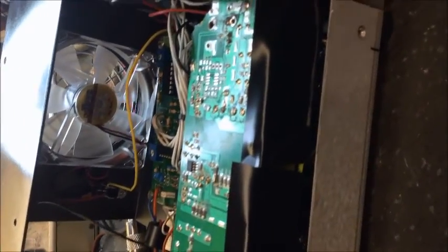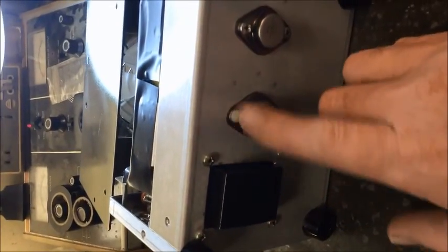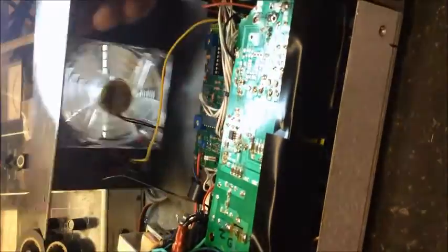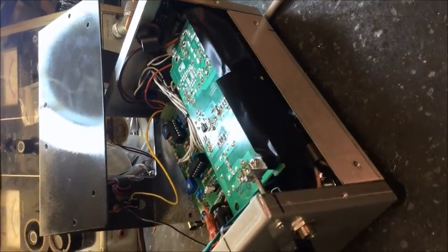These guys have been buying this one certain power supply with the Motormouth Maul modulators that need 3 different voltages, and they're tapping all 3 voltages off that supply. Well, that's good, and it works. I'm not saying it doesn't work. As you see, I took it out of the power supply's case, because it was an open frame that I'd bought, and I mounted everything on the bottom side of this 3-pill case that I had gotten. Basically, I went ahead and tapped all 3 voltages just like them guys do, and the problem I was running into was my plus 24 volts was actually dropping, and I didn't like that. I'd lost a couple watts out of the radio with it dropping like that. It rested at like 26 something, but when I'd key down it dropped to like 22.5 or something like that, and I wasn't crazy about that.